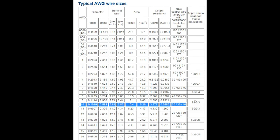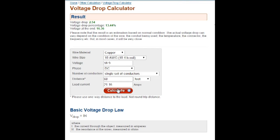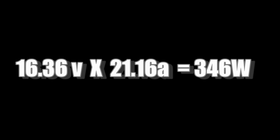Let's take a look at how much power we lose to resistance with this calculator using 10 gauge wire. There's a link to it in the description below. Entering in our starting voltage, wire gauge, amps, and the distance, we see that we lose almost 2.5 volts over the 60 feet. To put this in perspective, losing 2.5 volts, we go from the possibility of storing 400 watts an hour to 346 watts an hour.